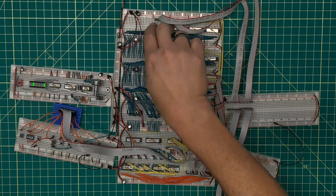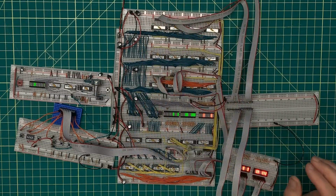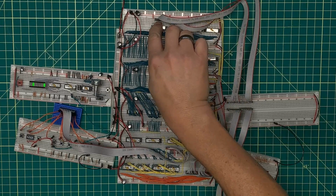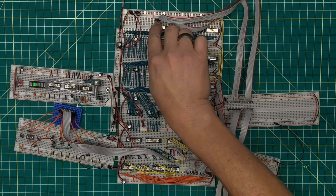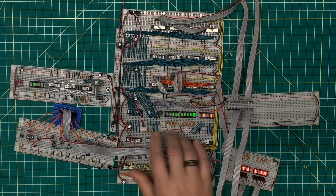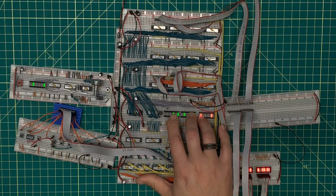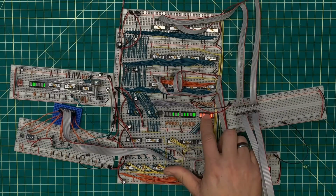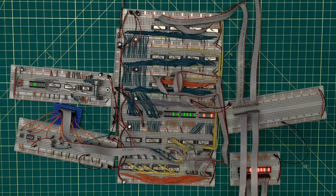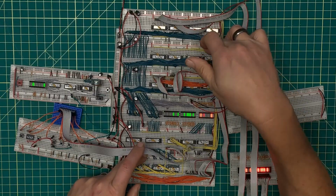I add an assert for, I'm pointing at address bus 1, but it's really to pass up to the instruction register. And then I need to be able to pull that down if nothing is being asserted. So we have to have a little bit of extra logic specifically for that. I don't need the counters, but I do need the latch chips. I do need to be able to display the output and contents of that. And then of course I want to have some LEDs to indicate control. So it's going to end up being probably 4 breadboards for the fetch register.